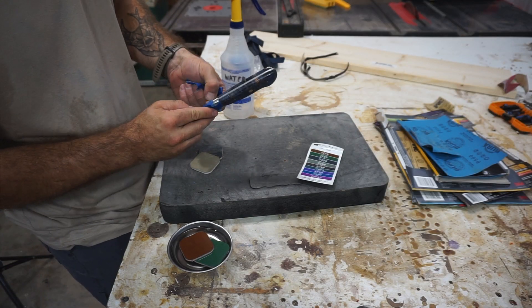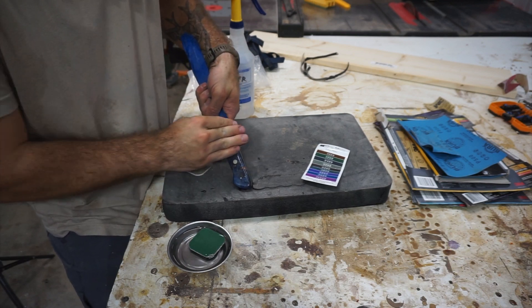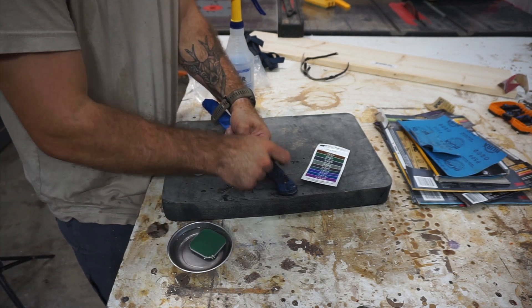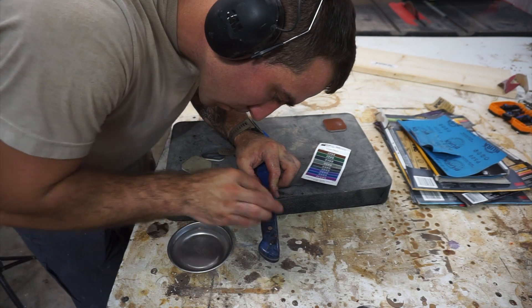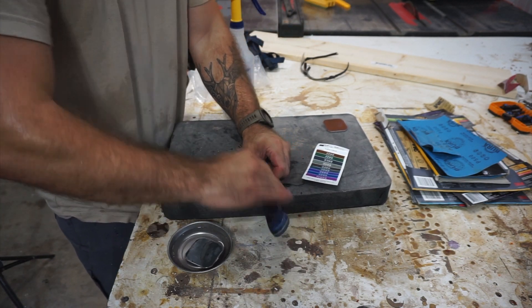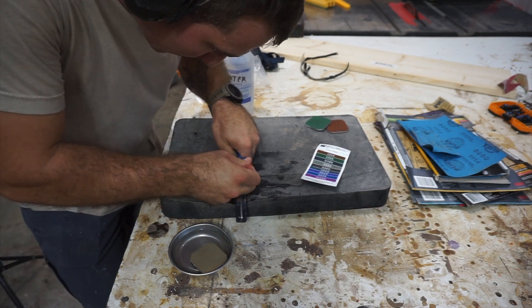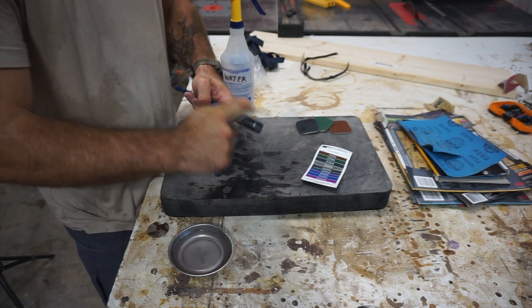Now that all the finish is applied, we can take off that painter's tape and really buff up the finish with these two-inch wet sanding mesh pads. These will buff the CA finish as well as the stainless steel bolster. These mesh pads start at 1,500 grit and go all the way up to 12,000, which gives a high-gloss finish. However, I only sand my knives up to 3,200 grit with the gray pad because I don't want a slippery high-gloss finish on my knife handles — I want there to be some friction between your hand and the handle when you're cutting things. I think the high-gloss looks really nice, but the more matte lower grit has a little better functionality. I use a No Cry Gear Garden Kneeling Pad to buff these on — it's soft, so I'm not worried about nicking the finish. You can use a bar mat, an old yoga mat, or carpet squares, but I really do like this little kneeling pad.